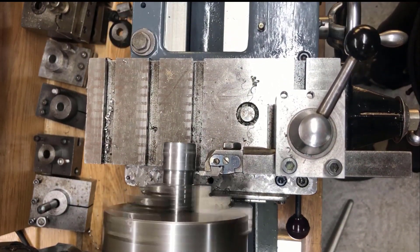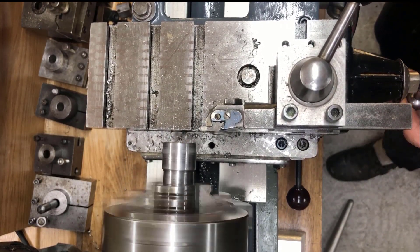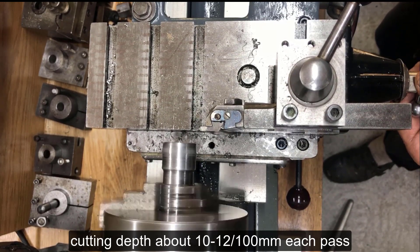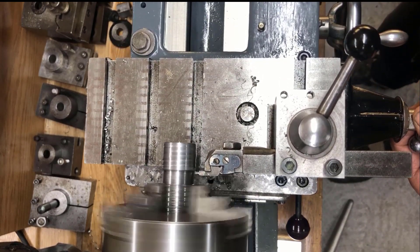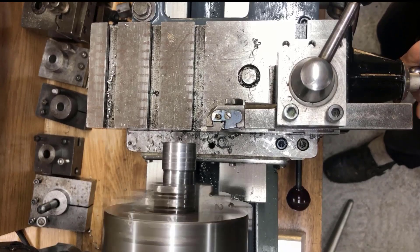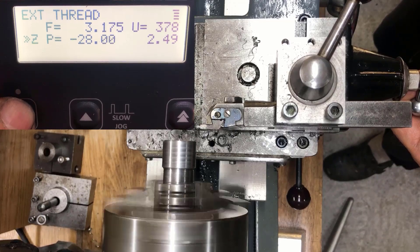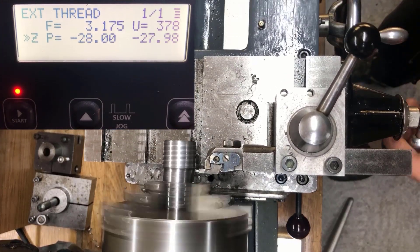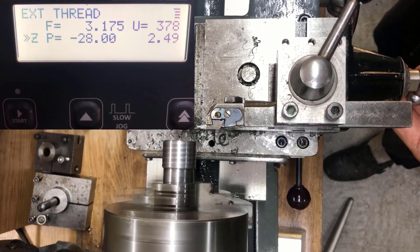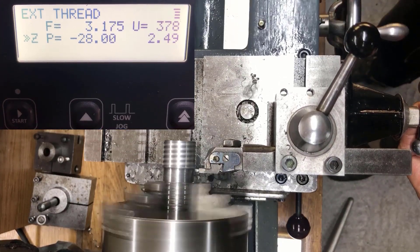The cycle starts. A little bit shy so I adjust inwards. I'm feeding in about 12 hundredths of a millimeter for each pass, and the ELS will tell you when to retract the tool back again. Starting is by pushing start on the ELS, and then you see it says 'retract,' so you just retract the tool and the ELS automatically moves back to the starting position, upon which you press start again.